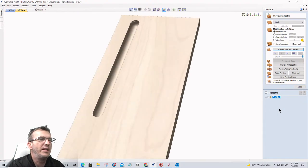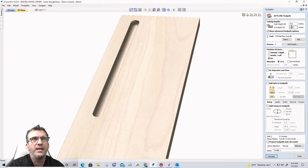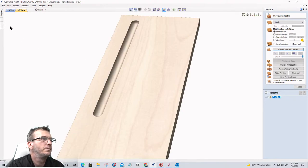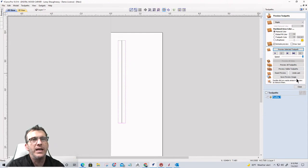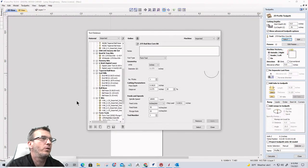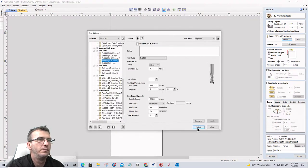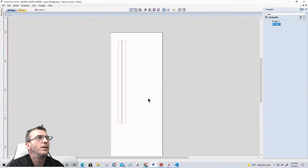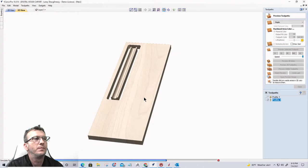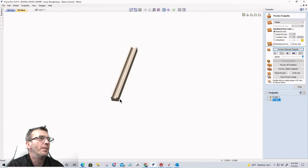And 1/4 inch is a bit deep. It just needs a small groove, so let's go 1/8 inch deep. There we go. And then I'm going to do a profile cut, cutting all the way through the material, 3/4 inch thick, on the outside of the line with a 1/4 inch end mill. I'm not going to do tabs because this is a small piece, so I'm just going to use two-sided tape. This will be my chalkboard tray, and this will just get glued right to the face of the other project, right?